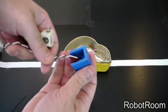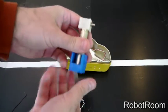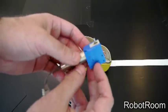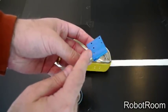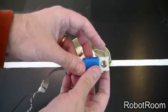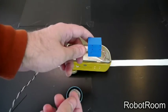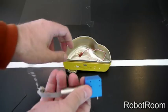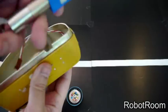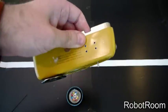You feed the cable through and it slides on and clicks into place. There's a set screw here and a set screw on the other side that holds it against the gearbox. The gearbox is made out of metal and is fairly strong, as opposed to the plastic portion up top, so it's safe to use set screws there. Once tightened, it's put into place, and there are four threaded holes and four clear holes through the mounting block so it can be mounted using fasteners. That way the height and position are exactly right, and it stays in position.